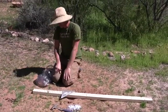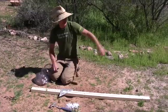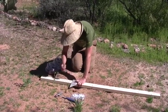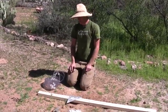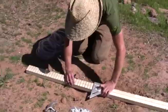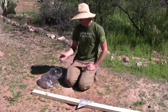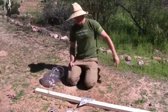There are lots of different ways to do it. Some people will just buy some cheap measuring tapes, nail them to the top, and string them down. That works also, but this is just as easy for me and the dark black lines give you a nice reference. After some time the hose will get a little bit cloudy, and to see through it it's nice to have a lot of contrast. If your bunyip does get cloudy it's probably because of mineral deposits, and you can remove those just by running vinegar through — pour in about a half cup and swish it back and forth until it goes away.